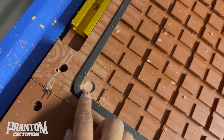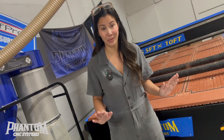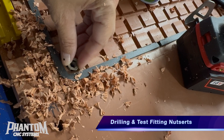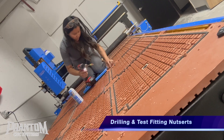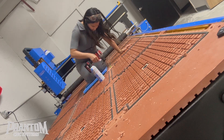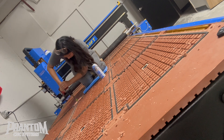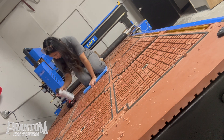It's always a little nerve-wracking cutting into the bed of your CNC, but every location for every Nutsert is exactly where I wanted it. Now it's time to drill by hand down to depth and test fit these Nutserts as I go. They're a bit tapered at the top, but I wanted the fit to be snug at the bottom, so I would use my drill to widen at the top, move the debris with a little compressed air, and test fit the depth as I move all around the table.